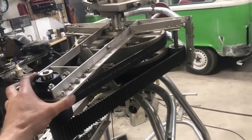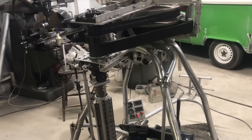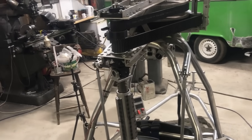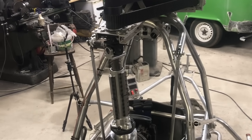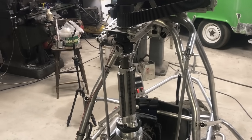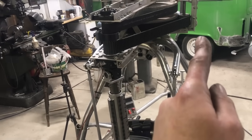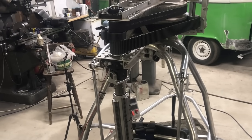At the moment the tilting of the head left and right in roll is only two and a half degrees, but it needs to be four degrees. I need to retest that four degree range and check this velocity issue with the universal joint. I don't honestly think it's going to be a problem — it's only 27 RPM variation over 5,500, which is 13 up and 13 down. I don't think that is significant, but I'd like to get the engine running again, get to four degrees, and just check it doesn't wobble left to right.